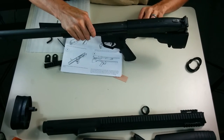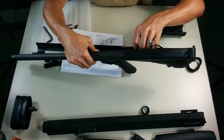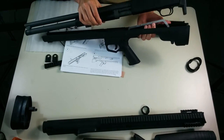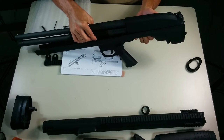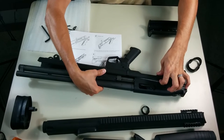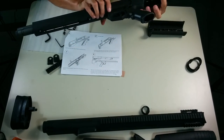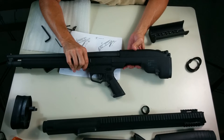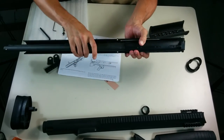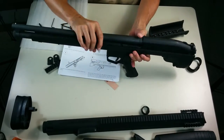As we set this in, we have to lift the trigger bar up and make sure it is actually in the trigger area, so it's resting on the front of the trigger — that's what's going to push the trigger. We need to be sure the trigger bar is sitting flat once it's down in; otherwise it'll rub against the side and bind. I keep pausing because it seems like it should be more difficult than this. It's going together even quicker and easier than I expected.